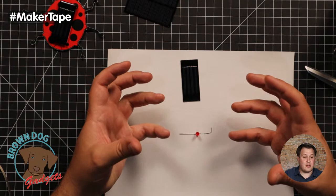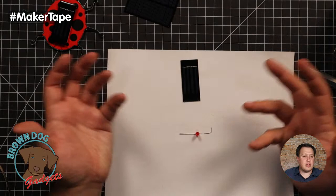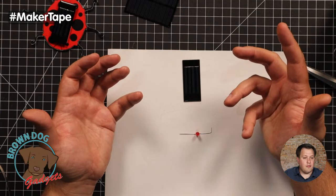You put them into a boiling pot of water to melt the wax. They're grade B, so they're just cosmetically off. There's like a chip on the side. Maybe they're like 98% as good as they should be, but they can't sell them. So he'll buy these really cheap and sit there and solder all the little connections together, wafer to wafer to wafer, with basically almost like an aluminum tape type material. And he builds one every summer with a goal of generating way more power than they need.